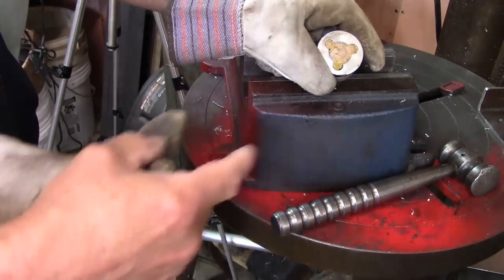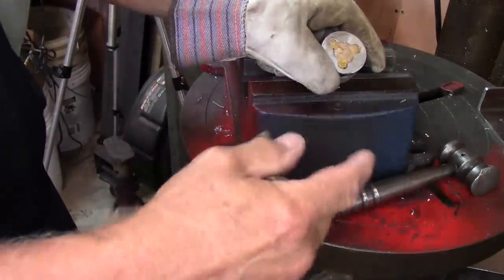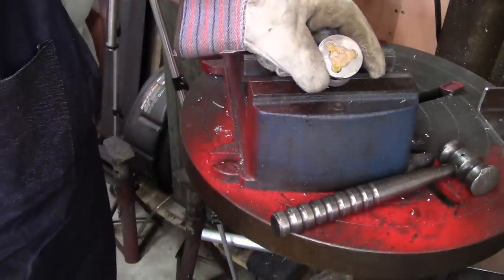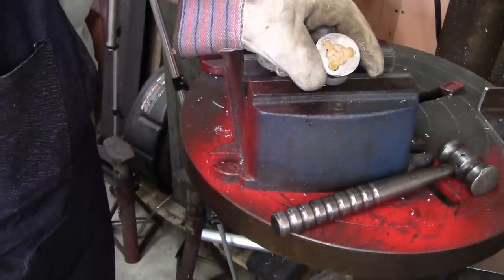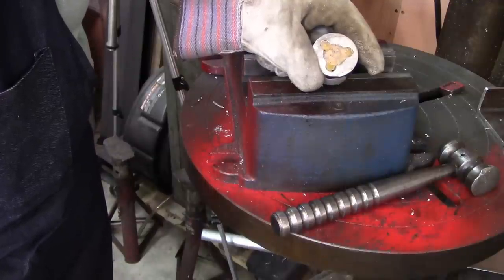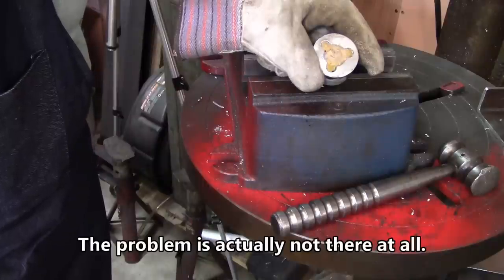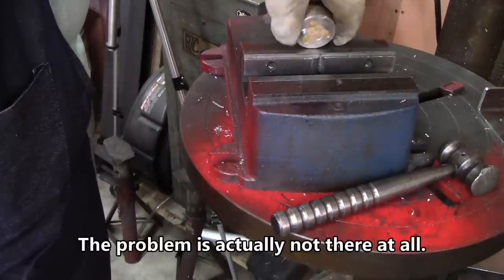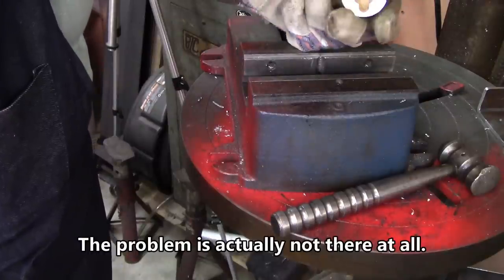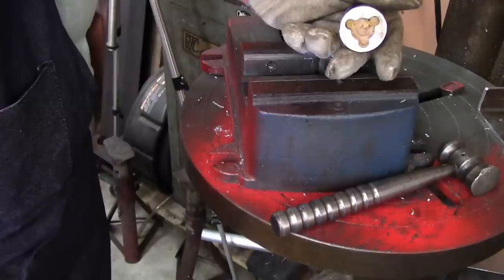When I make the knobs that are facing the other way, they come out of the mold pretty quick. I just unscrew the mold off of them. This one is going to be another kind of problem altogether, and I have to figure out a way to eject my part from the mold once it's made. Maybe just let it cool off, but I've noticed the stuff shrinks a lot when it cools off. So if I let this get nice and cool, it may just pop out of there.